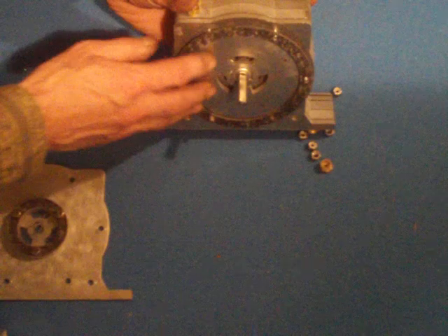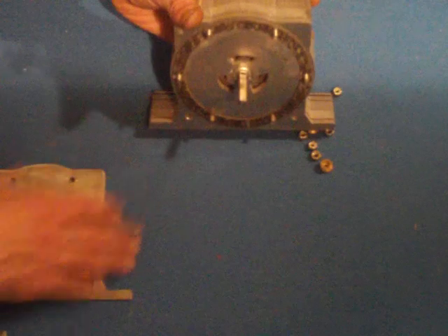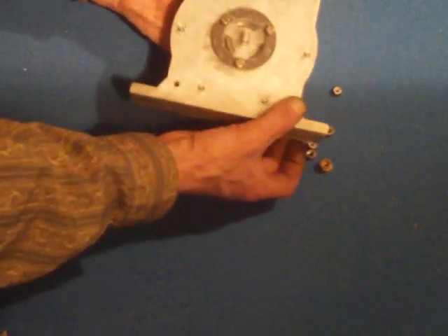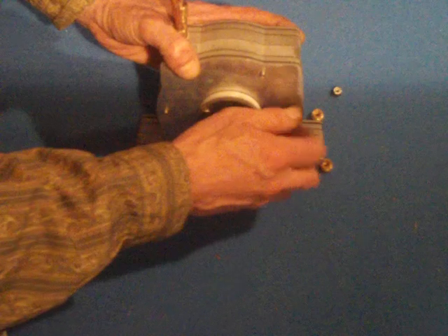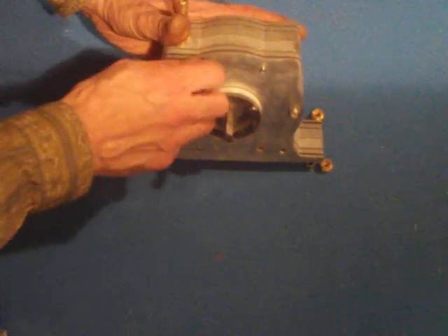We add the 1/16th gasket here — a high-heat carbon fiber gasket, high strength and reusable — then add the outer output shaft side cover plate. Now the turbine is together without needing to disassemble the lexan cover. We fasten the bolts with nylock nuts, finger tight first at opposite sides, keeping pressure equal to avoid warping the plate. Make sure all screws are flush and have their washers in place.